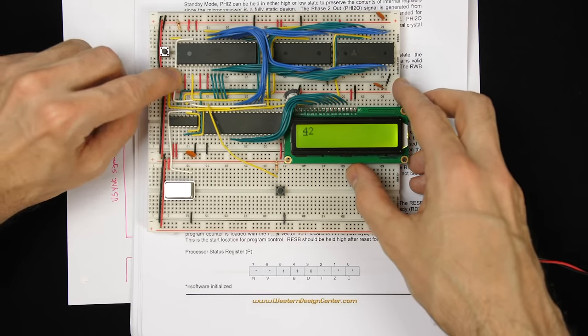This idea of hooking up multiple things to the same bus — each of which can control the bus at different times — is sometimes called bus mastering. At any single point in time, there's one thing that is the bus master, which controls what's happening on the bus. We'll have some mechanism — in our case, figuring out whether we're in the display interval or the blanking interval — that switches what the bus master is. During the display interval the VGA card is the bus master; during blanking the CPU is.